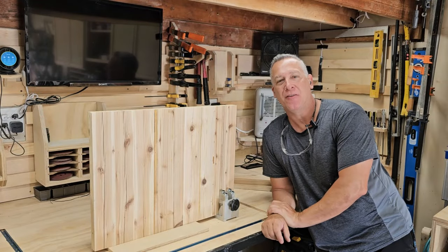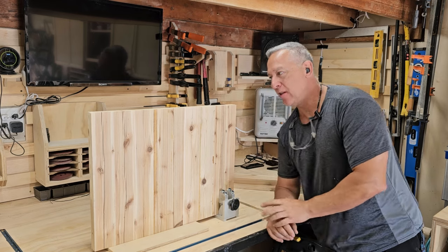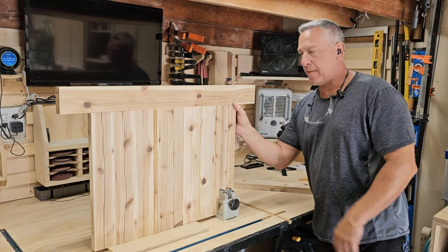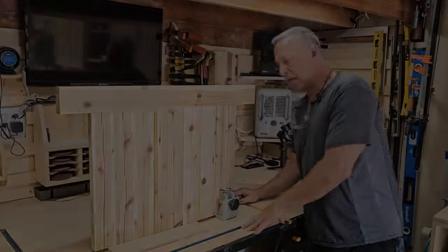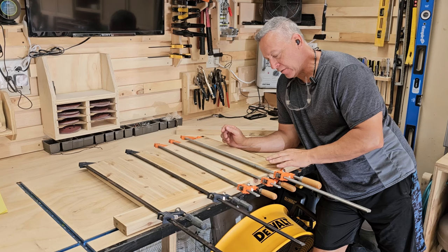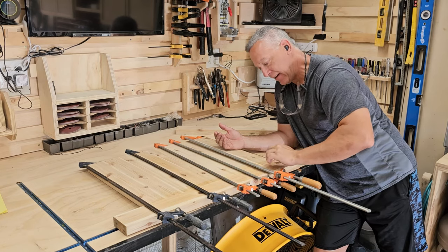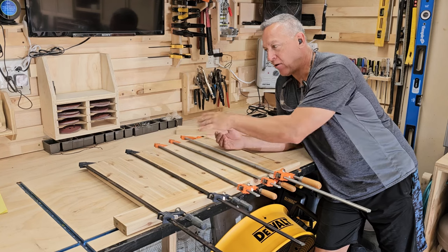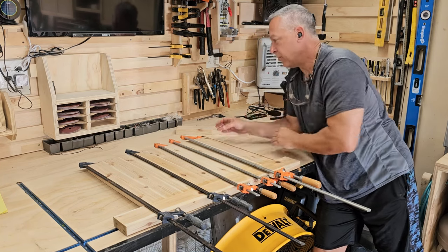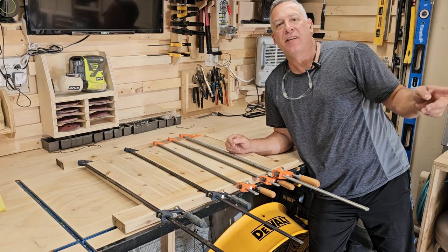I noted I said I wasn't going to be using pocket holes in any of my outdoor furniture builds anymore, but I'm going to do it here only because I want to make sure there are screws keeping this stuff together — we're going to be gluing end grain to side grain. I want to make sure there's more reinforcement by using screws over the long term. I got the first set of clamps on. I opted not to glue both sides at the same time because whenever you glue up boards, occasionally you get a little bowing, and I wanted to focus on this seam being very flat. So I'm just going to glue up this side, let it set, put the pocket holes in, and then glue up the board for the other side afterwards. While the glue is drying, I do have other projects I can work on in regards to the table.